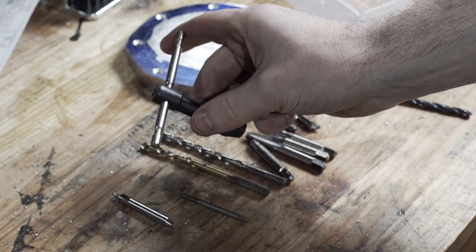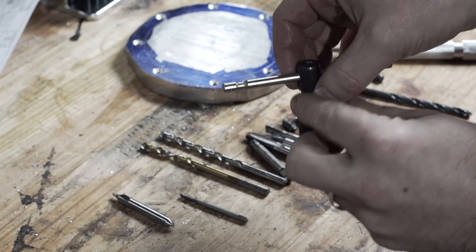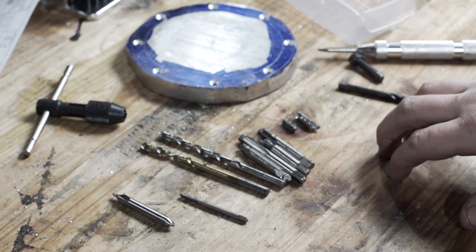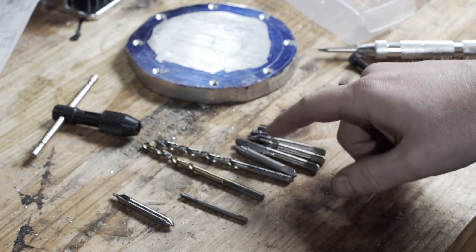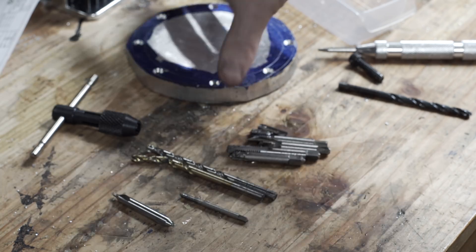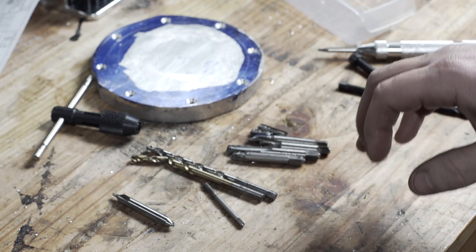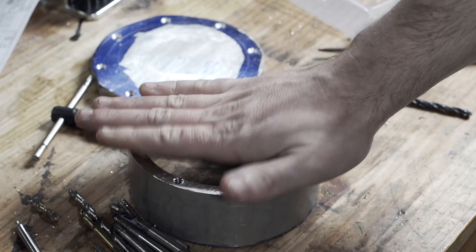Part of the problem is my cheap T-handle tap wrenches — they don't grip well and slip, so even with the spring-loaded tap guide keeping things concentric, the pressure isn't always even and it tilts a bit, which probably contributed to the breakage. I have some nicer tap wrenches in the mail. I need to stock up on taps in common sizes. All in all, an interesting learning experience. I still need to drill these holes out to accept the 1/4-20 and get everything assembled. Things you expect to take twenty minutes end up taking two hours. Biggest lesson: don't use stainless.